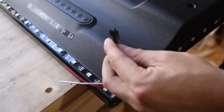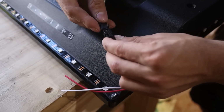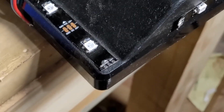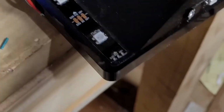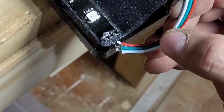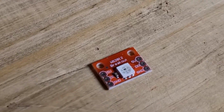And on one end, we will have 3 wires, 1 red, 1 white, and 1 green. It's important that you start from there and make sure that where the wires start, it says plus 5 volts, DIN, and ground. If you happen to be missing, for example, 1 or 2 LEDs like me, and you don't want to buy another full meter, you can buy these independent LEDs. I'll also leave it in the description.